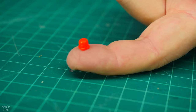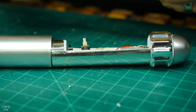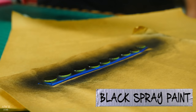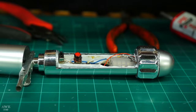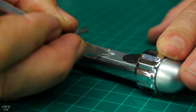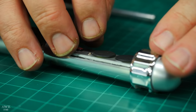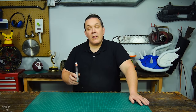I need to drill a hole right here. This is the original button from the toy — if I put it through my control surface and glue my black button on top of it, then if I ever remove this to play with the electronics the whole thing will come free instead of gluing it directly to the switch. They're not supposed to be yellow so I'm going to spray paint them black first. If you stick little parts to tape they won't fly away when you spray paint them. I'll reuse the micro-screws from the red toy to attach the silver faceplate and glue the black buttons on, scraping down to the plastic because plastic cement won't stick to paint — plastic needs to glue to plastic. I then carefully glue the last button on, making sure I don't glue it to the control surface.